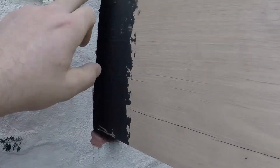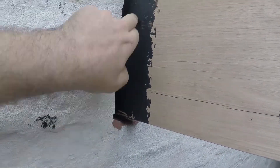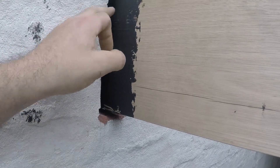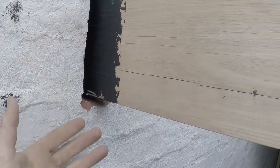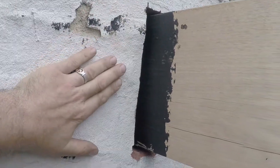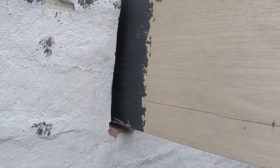Just while I've got you — you will see that we've checked it into the brickwork and we've painted the ends of our timber with a bitumen paint on this one, not a rubber. What that'll do is stop any moisture coming from this masonry wall into this timber and rotting away the ends of our timber.